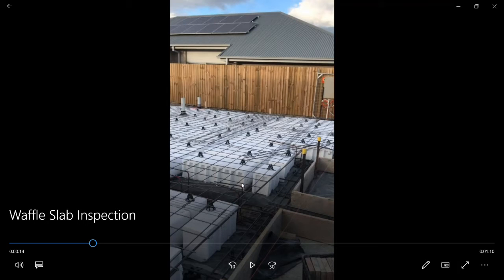This big area through here is the stiffness required to support the footing that comes out in front to the right. The space where there are no pods will be concrete — so in this waffle slab, this area will all be concrete and it'll continue out through the middle here.